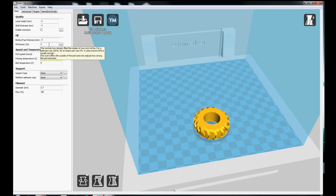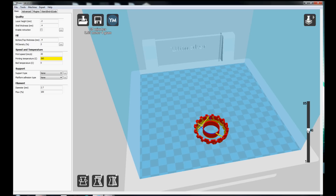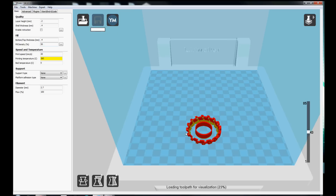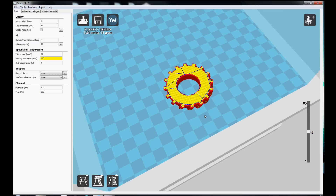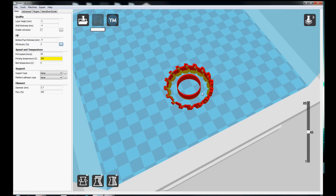On the left side where it says fill density, you use this option to control how dense the part is with infill. Since we want the tire to be mostly hollow and very squishy, we set the infill to 2%. As you see, there are just a couple of lines cutting through it but they're not necessarily in the right spot. If I increase the infill percentage you can see it more evenly fills out the volume, but then it'll be tough — still rubbery but not as soft as if it's hollow.